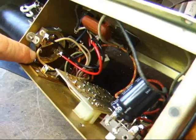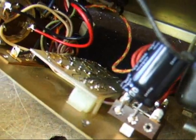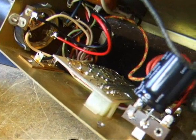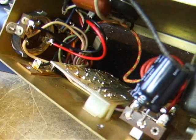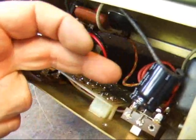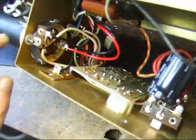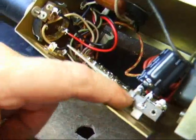You'll follow that white wire — it goes down under here, out to here, and on to the bridge rectifier. It's the minus side of the four diodes. There are two diodes at that end, and that's the minus side. So this is the minus, and if you look at the capacitor you'll see it's got a stripe and a minus marking, and that should go to the can which is here, with the positive going here.